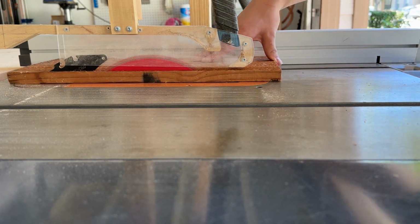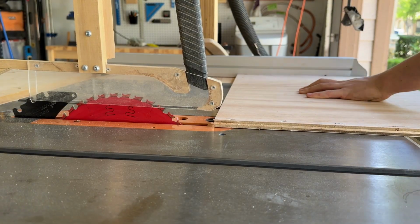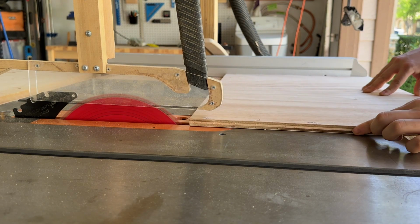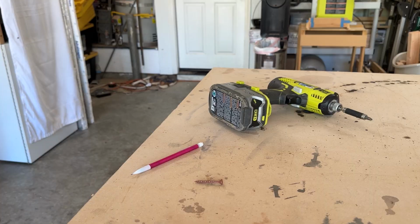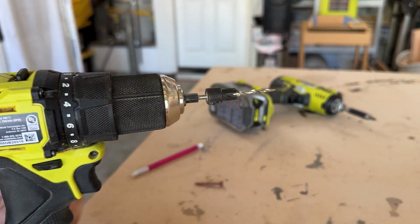But basically, I used some scrap wood from the corner to build a couple of shelves to hold the vacuum and dust separator in line vertically. And the entire frame was made very simply with just screws and butt joints. I just made sure to use referential measurements whenever I could, and it ended up being a pretty nice fit.